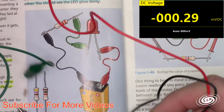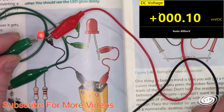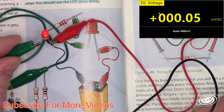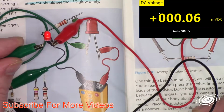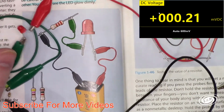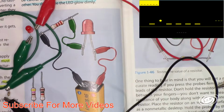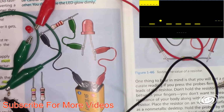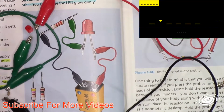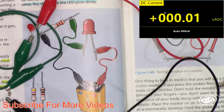So here is our rat's nest all in the shot. So I got my LED and my LED lights. Doesn't light very brightly. So what I want to do is find out how much current that is drawing. Okay. So what I'm going to do is take my thing out of remote, and I'm going to plug in my meter to amps. And I'm going to select amps. And then I'm going to display my amperage. Change my clips out.